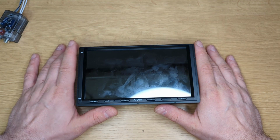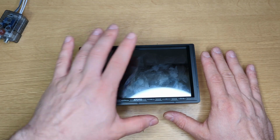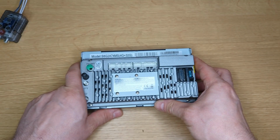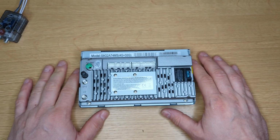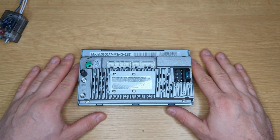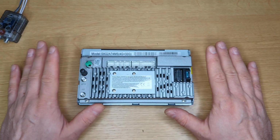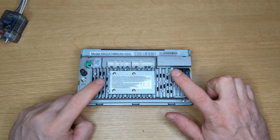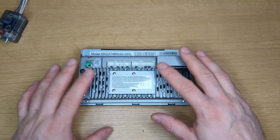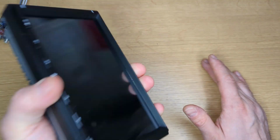If you have this head unit or a similar one or any kind of Android head unit, don't spend a lot of money on amplifiers if you want to keep this head unit, because you're not going to gain anything by connecting a very quality SQ amplifier from reputable brands like JL, Alpine. Even Kicker amplifiers are probably cleaner than this, so don't waste money there. And if you want something better than this, look out for one with a digital output, or at least with some RCAs. So we kind of came to the conclusion that this head unit is really not for SQ.